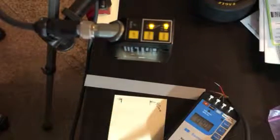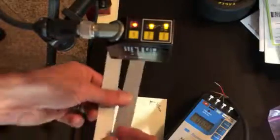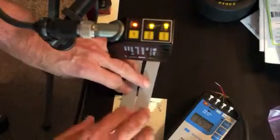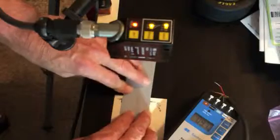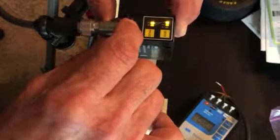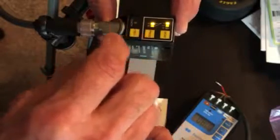What I want to do is have a tighter range, so I want to teach a new 40 millimeter range. These reflectors are 20 millimeters wide so I'm going to put these together, and I've already marked it here. I want it to have a new range so it's going to teach the new range 4 to 20 over this width of the reflector. So the way I'm going to do that: go to my sensor, I'm going to hold the set button down — this is past the switching outputs into a faster blink — and then I'm just going to hit the set one more time.